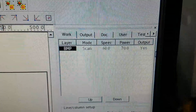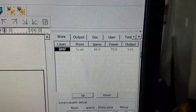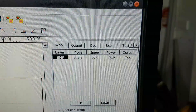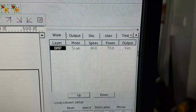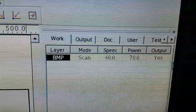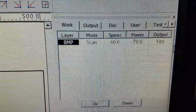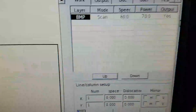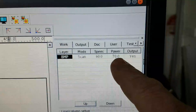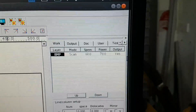In continuous terms, the laser doesn't actually initialize properly until about 13% output. Running continuously at about 50–55% of the power supply output on these typical setups will give you about as much as the laser can do in a continuous cycle. It's only because we have time off that we can throw more at it. Don't think of that power percentage on the screen as the output power of the laser — it is the output power of the power supply feeding the laser. That's a very important detail a lot of people overlook.